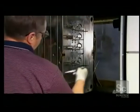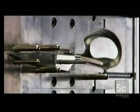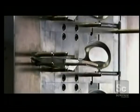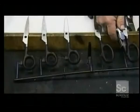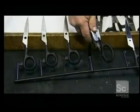Workers now load six blades at a time into an injection molding machine. The machine shoots molten plastic into the cavities, then rapidly cools the material until it solidifies. Each blade exits the machine with a molded handle firmly encasing the tang.